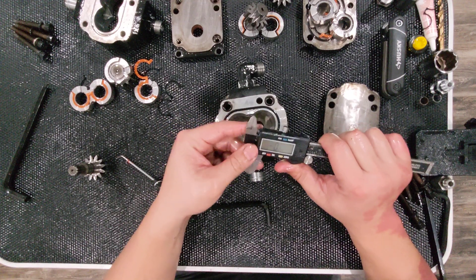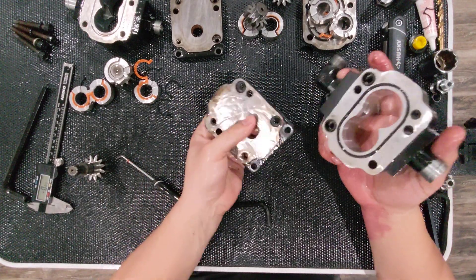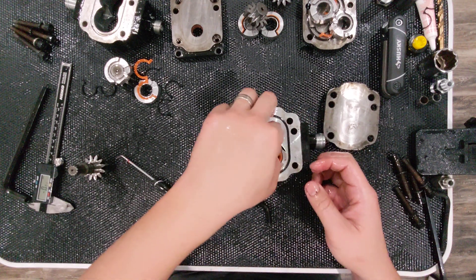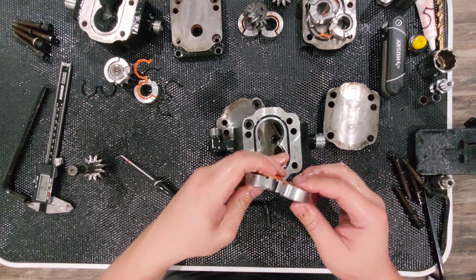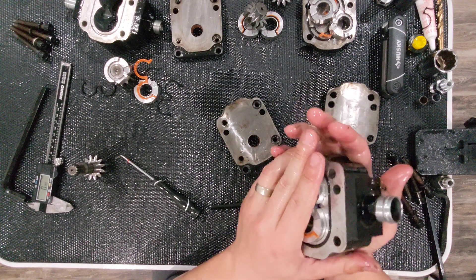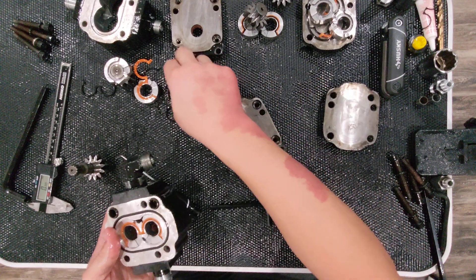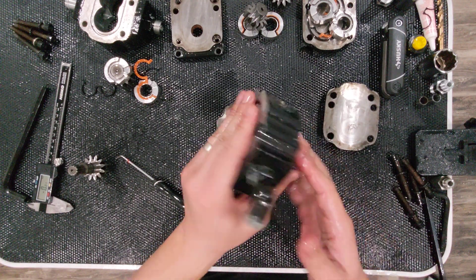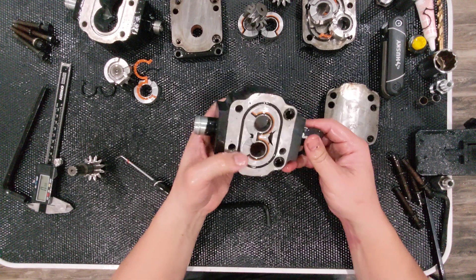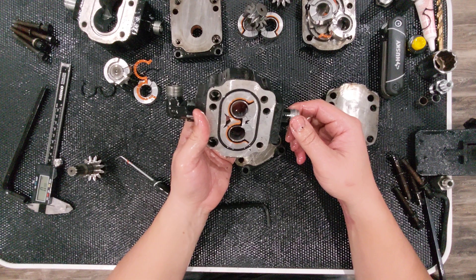So that's the difference — I thought this was interesting and wanted to share it with you all to give you a sense of what you're dealing with if you're interested in upgrading to the 2025R pump. Keep in mind, this is actually backward from what I did. Simply upgrading to the 2025R pump does increase some performance, but it's not very much — noticeable but not obvious. Adding the hydraulic modification to a stock pump is much more noticeable than just swapping to the larger pump. I'll eventually do comparisons to help you understand.